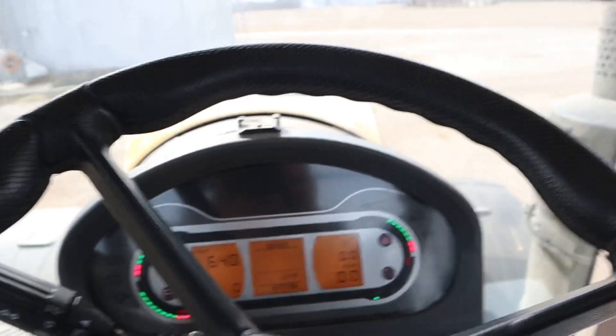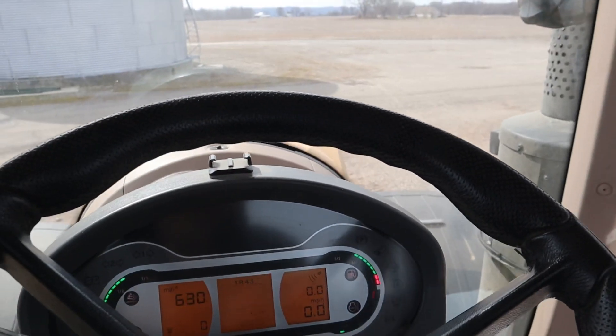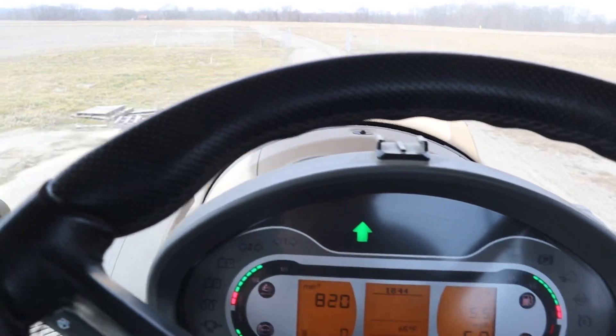We just had a little bit of an issue with the 1038, but everything's moving now. The seats in the 1038s are an active seat — basically there are four firmness presets and they automatically adjust to the operator's body weight. Pretty handy when it works. It wasn't working yesterday; it was stuck completely up in the air. We called Ohio Ag and they came down, fixed it — they had to put a computer in the seat. Long story short, I could not get the tractor out of park after they left. Disconnected the battery, network's fine. Something's getting too smart.